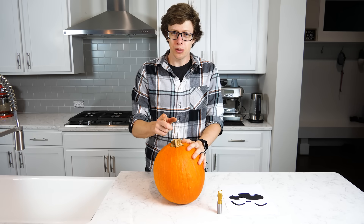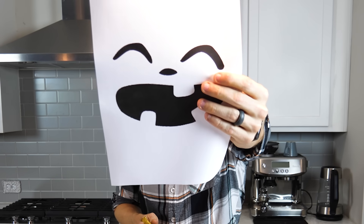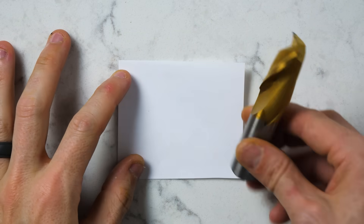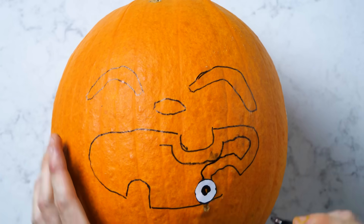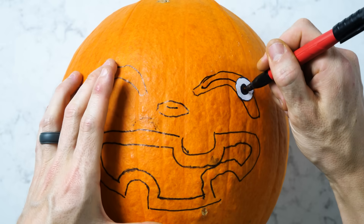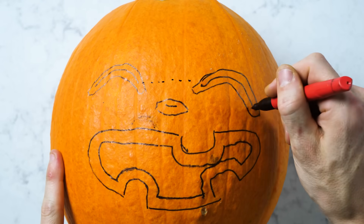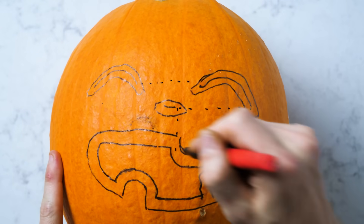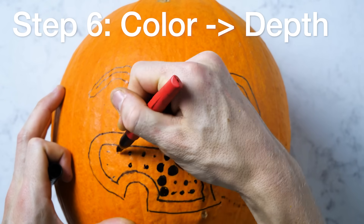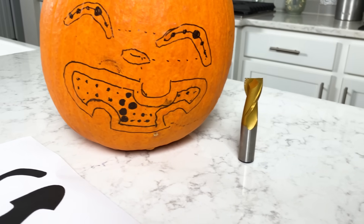Welcome to my kitchen — I'm going to teach you how to make toolpaths. Take your desired image and map it onto the pumpkin. Find the outlines of all the regions, then offset the edges in by the radius of the tool to ensure you cut the right shape. If the tool is too big for the region, cut down the middle — better to have something than nothing. Then make moves for the robot to go from one region to another, and you're ready to cut outlines. To cut a lithophane, fill each region with horizontal cuts, then set the depth of each cut according to the color of the picture. And that's all there is to it.